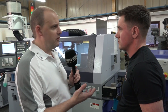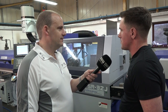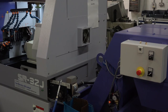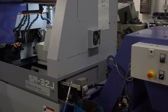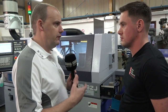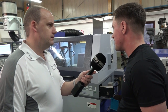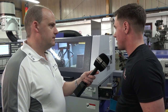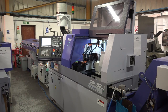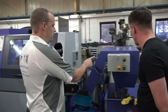Would you go up to 35 or 36mm? We haven't done yet. The biggest we've done is around about 30mm at the moment. Now with this sort of machine you're looking at removing material and getting parts off quicker. With that there are cycles like balance turning — do you do all that, getting the best out of the tools you've got? Generally we haven't done any balance turning yet. It's only been here around six months, so we are continually training our programmers on that and it's something we can look at in the future.